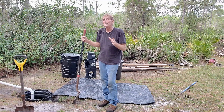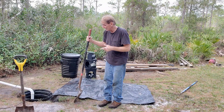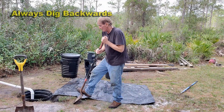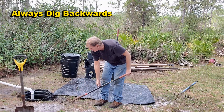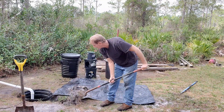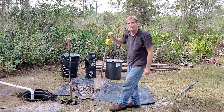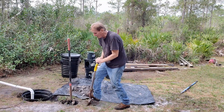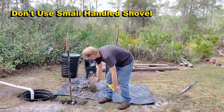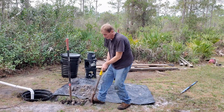If you've watched any of my videos, I give you a lot of information and tips on how to install these systems. The first tip is: when you're digging your trench, lay out your plastic so you can set your sod on one side and dirt on the other. Always dig backwards and set your dirt right on the tarp so you can easily put it back. If you try to use one of these small shovels, you're going to be hurting really bad — it's too small, and by the end of about 20 minutes your back's going to hurt. This is not the shovel to use to dig a trench.